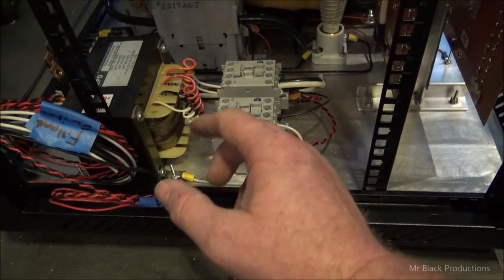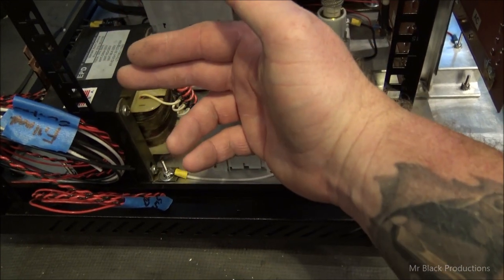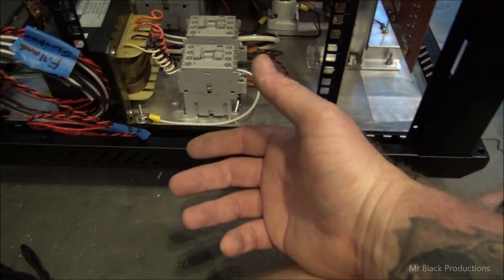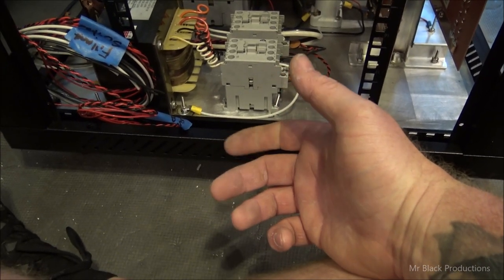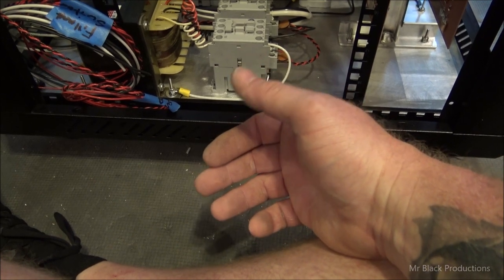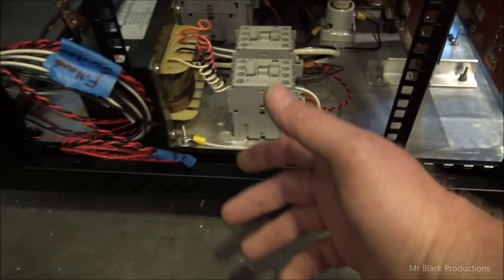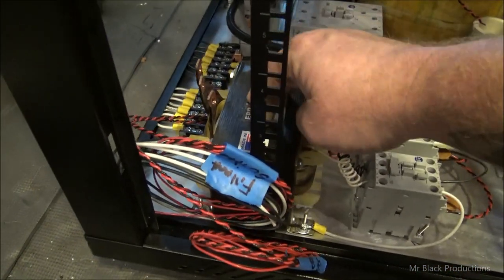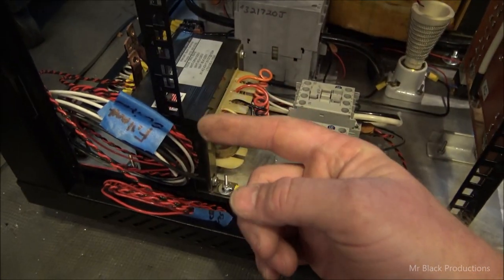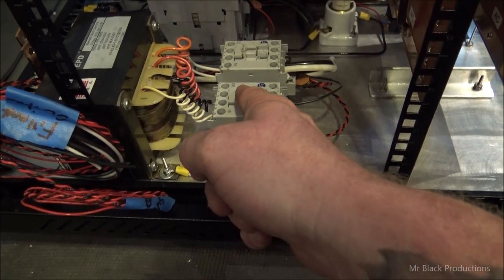Okay. Well, when this has come online, like I said, it'll kick on your ability to key the amplifier. What I mean by that is all the relays inside this box are going to be run off DC current. It's a lot safer in a lot of different ways, which we're not going to get into right now. But that'll allow us to bring our bias, which comes off of this center leg of the filament transformer, online as well. So this will bring the tube on.